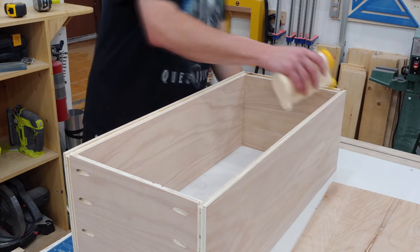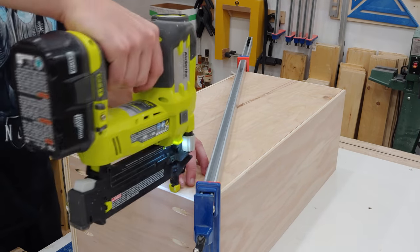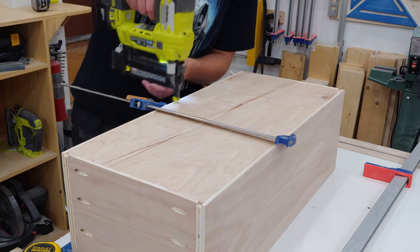This deep drawer was slightly out of square, so a long clamp was added across kitty corners to suck it into square before driving in brad nails to hold it permanently in shape. Again, I measure the front, back, and middle before nailing down and keeping the sides parallel due to bowed plywood.